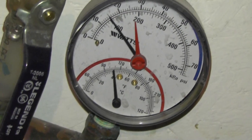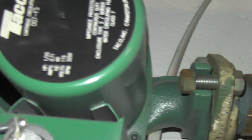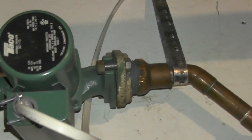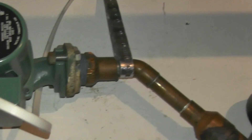It's very quiet. One twenty-fifth horsepower. 110 volt. What is the thermostat? It's wired in series with the motor. Yeah, I got just one piece of 14-2 going to the thermostat and then this piece of 14-2. I just got my neutrals connected together and then two hots to the switch. And then that comes to right here.